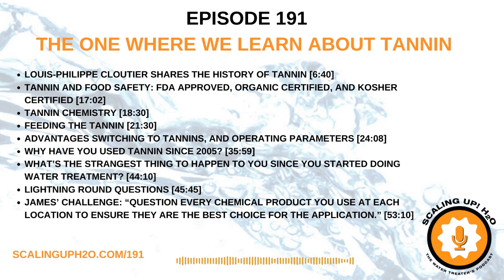Some people in the U.S. use tannin to replace polymer and sulfite and keep their separate means to treat condensate. But we also have an all-in-one product where we add ammonia — the ammonia is volatile in the steam to treat the condensate. We picked ammonia partly because of dairies and partly because the distribution ratio of ammonia is one of the highest, making it a product that works really well in almost all environments.